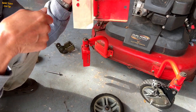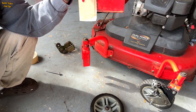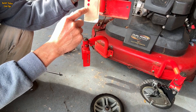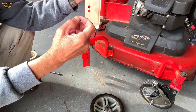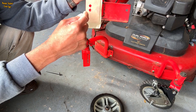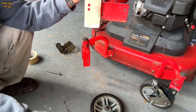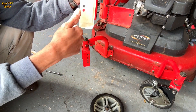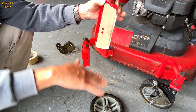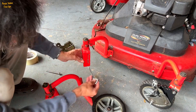When you start doing this hole, make sure you do it very slowly per side. Do it slowly with a small bit first — a very small one — and then keep changing up until you reach the size you need. Don't go too fast. Maybe professionals do it better than me, but when I did it I tried to go slow. That's why when the hole comes out, it's perpendicular — not up or down or one side or the other. That's what I did.